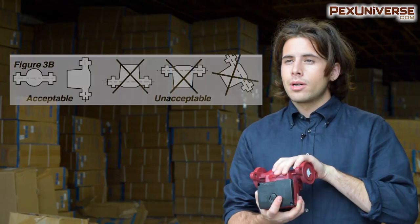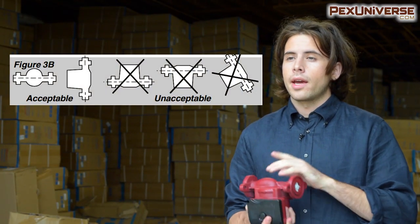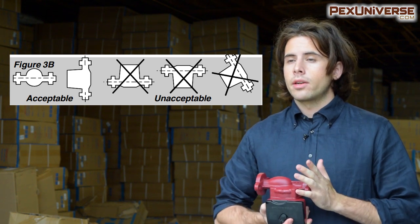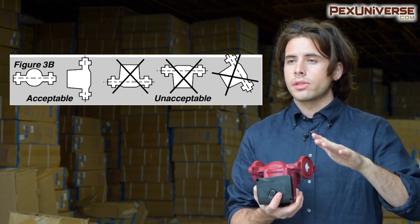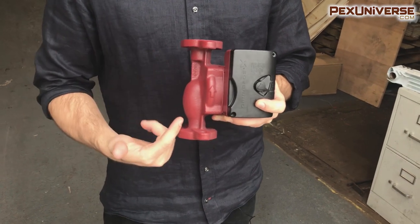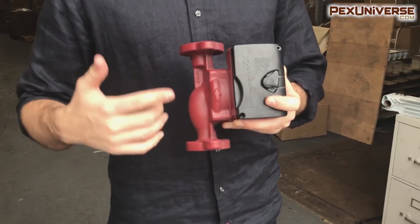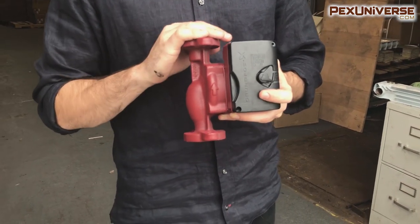There are arrows on the side of the pump that indicate the direction of water flow through the pump. These can be installed vertically or horizontally on pipelines, but you want to make sure the motor shaft is always horizontal once installed, as shown in the graphic. It's preferable to install circulators in a vertical pipe pumping upwards, which ensures the pump shaft is horizontal and reduces thrust bearing load.